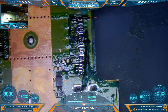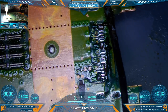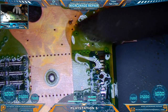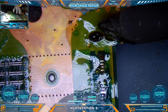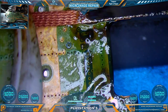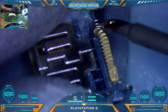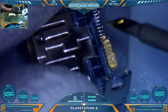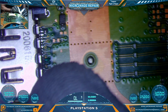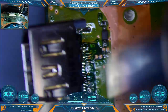I'm going to push off the rest till tomorrow and we'll fire it up and get started on another day. It is the next day and we still have some prep work we need to do before we can put a new port on this. First things first, let's cut off this excess wire. We need to wick out these anchors. We're going to flood these anchors with low melt — it's much easier to do with a port installed because the solder will climb up the leg and through to the other side. Tin our pins — this will help make contact with the jumpers. I tin the pins anyway, even if we're not running jumpers. The pins will reach even in the nubs and partially ripped pads. We will warm everything up first. Starting to see some wetting now. We can place our port.